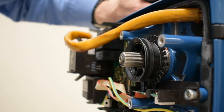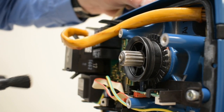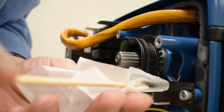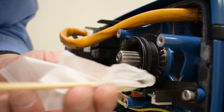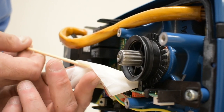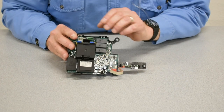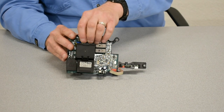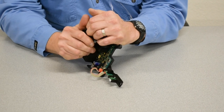Here's a green plug that suffered a power surge and has obvious signs of burning on the L1 leg of the plug. For quick cleaning and checking, we recommend using lens cleaning equipment for a camera such as a puffer and a light brush. We can also use a lens cleaning towelette and a wood skewer to clean the area. The pulse reader is removable for easier access. The newest style K1 main contactor on the newest boards is removable and replaceable as a part — we recommend replacing this on high cycling hoists. Simply undo the plastic clip and wiggle it off its connection.